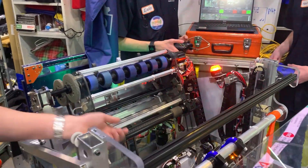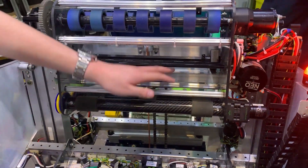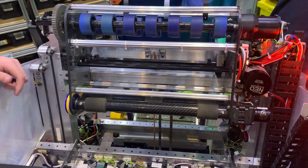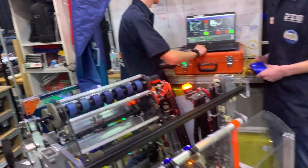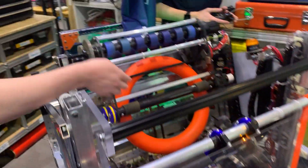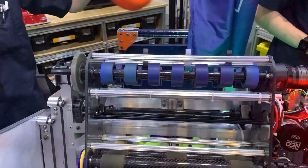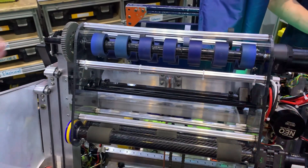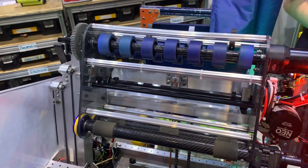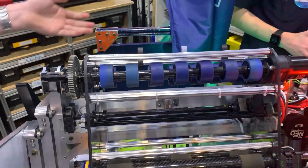Moving on to the rollers in the back — we have more carbon fiber rollers with a really specific spacing so the note doesn't get caught as it passes through. As we feed a note, you can see it goes in and only grabs on these two contact points. When it spits out, it only touches the rollers briefly, which means it doesn't get dragged down and the motor works as efficiently as possible. We went with stealth wheels here because they have a really good amount of grip and they didn't tear up the notes too badly.